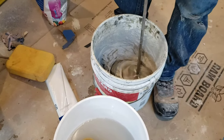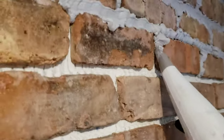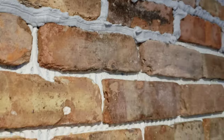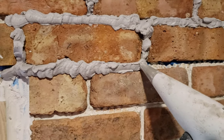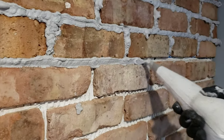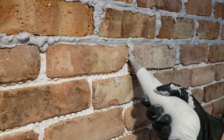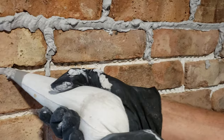We had to make the grout a little softer. It does work if it's not that soft but it's just a little harder to squeeze out. Make sure it comes out past the surface. The grout definitely has to be soft enough to pull out of the grout bag easily. You can make the grout harder but you're just going to have a tougher time pulling it out of the bag, which would make no sense. When you're dealing with bricks you have to do it with the grout bag — if you don't, it will not look the same.